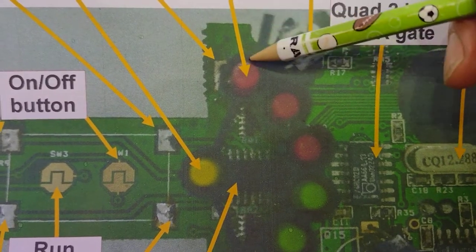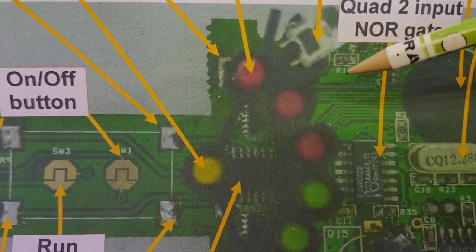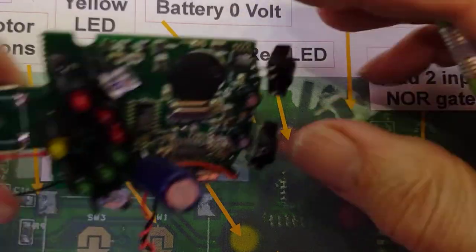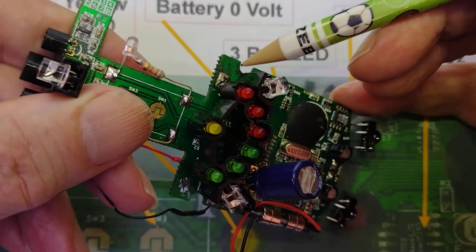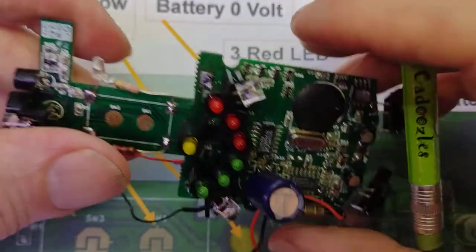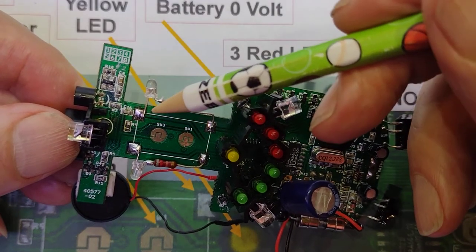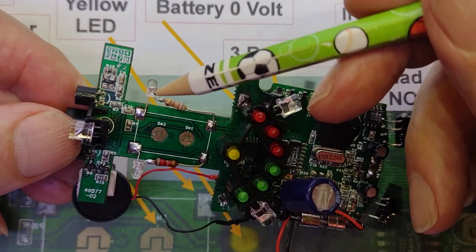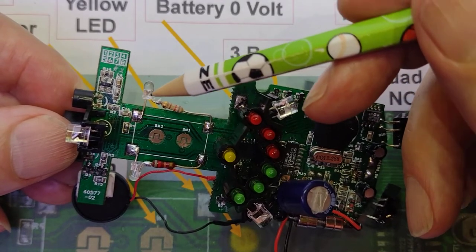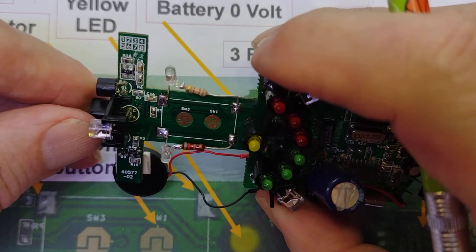We've got three red LEDs across the top here, which can be independently controlled. Coming across further, we have the nought volts — I had to unsolder this and take it away from the batteries; it's a solid connection where the connector comes through the circuit board. We've got the outputs to one of the motors, and so that I can experiment with it, I've put a bi-colour LED across — if the current goes one way it's one colour, and if it goes the other way it's a different colour. So those two LEDs represent the motors.